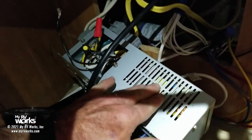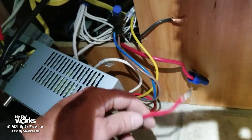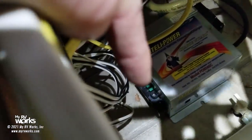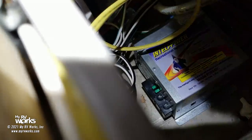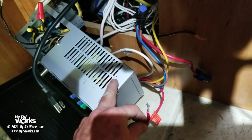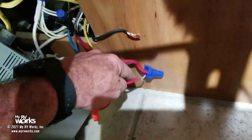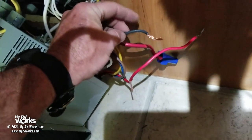The output of this converter feeds this wire. So I take this wire right here, and the output of that converter, it's going to be one of those two wires down there, is where I'm going to connect. It's such tight quarters in here. This wire that was coming out of this converter is now going to be connected to the new converter out. And I'm going to tie my battery in together. This wire here goes to my seven-way plug on my truck camper,